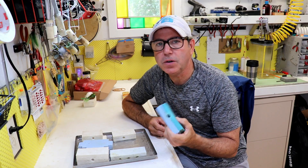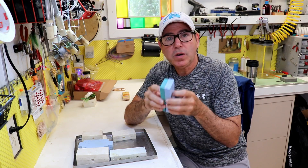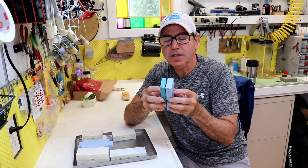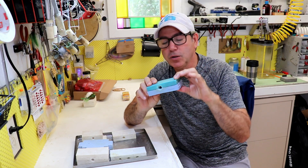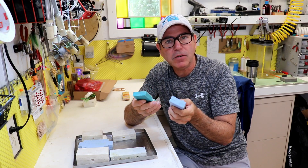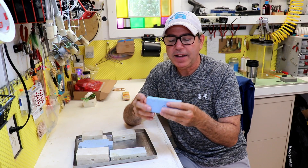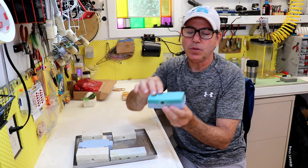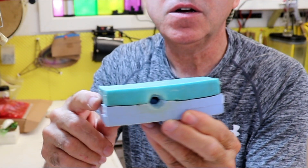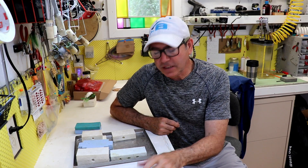A while back I posted a video on a couple of things not to do when you're pouring your mold, and one of them was that you should not pour two different manufacturers of silicone on the same lure mold. The reason is each one has a different amount of volatile solvents that slowly gas off, and the shrinkage is different. On this one you can see that the top one has shrunk quite a bit more and it creates a little bit of a curve.